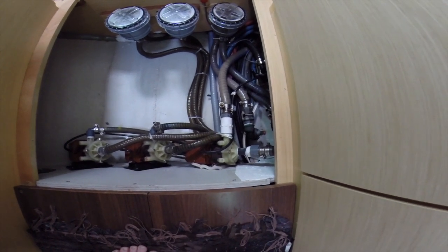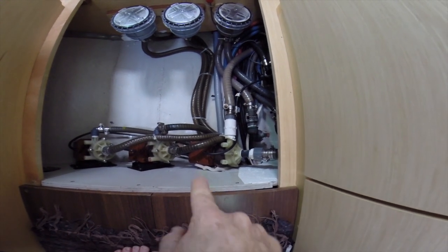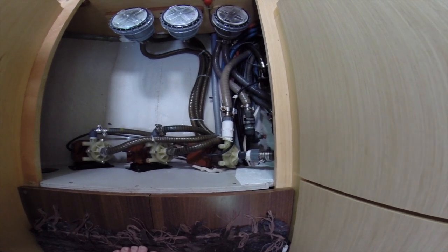Now that's important, because if one wires that through an inverter or something like that, this pump could run and cause water to flow into a generator that's not running, and that could result in water on the pistons. So very importantly, one needs to wire the pump directly to the output on the generator side. This means when the generator is switched on, the pump automatically comes to life, and when the generator is switched off, it automatically is killed.